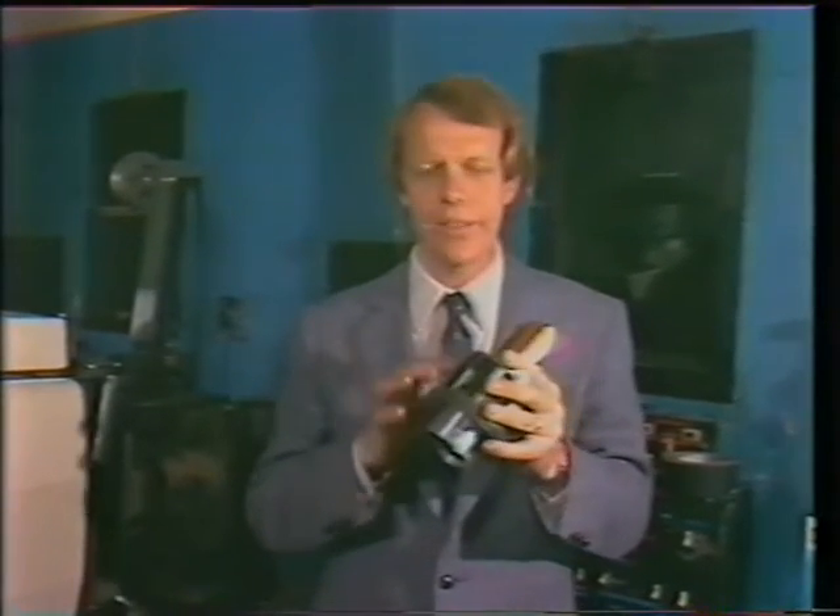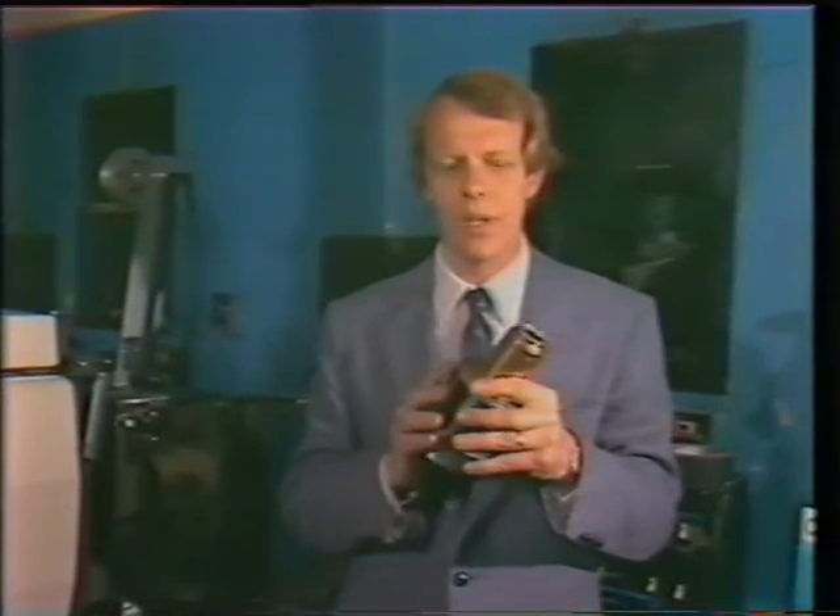We're almost ready to project the film, but we've forgotten the most important element: your projection lens. As with the lamp housing, check it out for dirt, scratches, things that will interfere with the light. 3D seems to have the ability to highlight every flaw in the optical system. This lens represents one of the cheapest investments you can make in getting more light to the screen. If you're using a standard flat lens and you have a 1.85 screen, the focal length will have to be 0.7 times the focal length you use for flat. If you're in doubt as to which focal length to use, contact 3D Video — we can supply you with a chart. You'll also need a projection device.